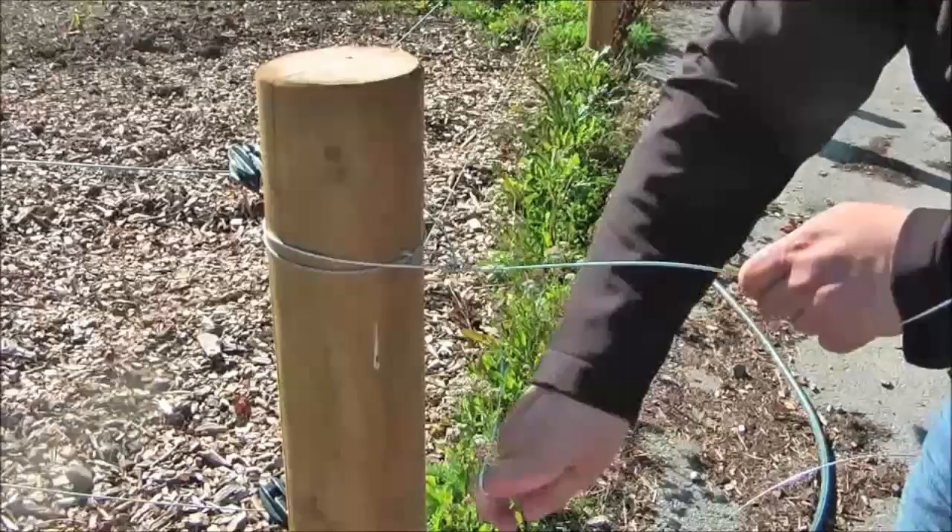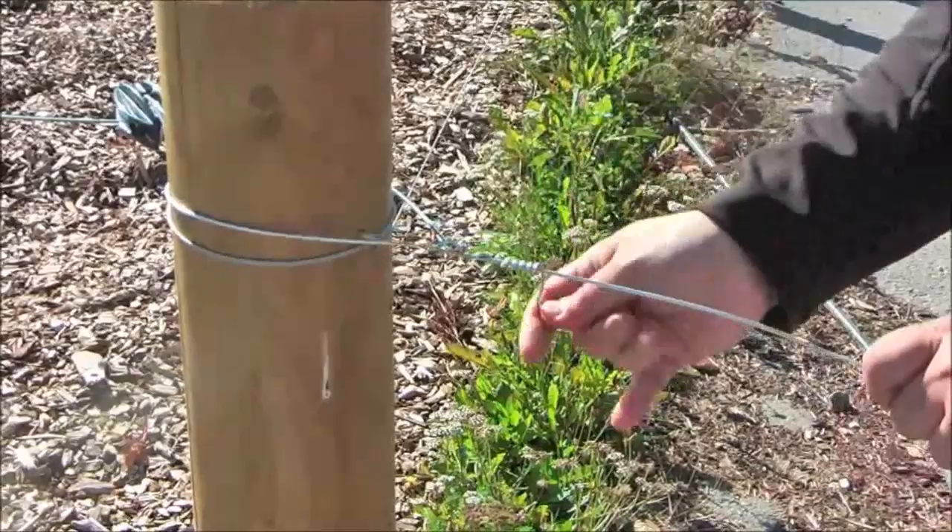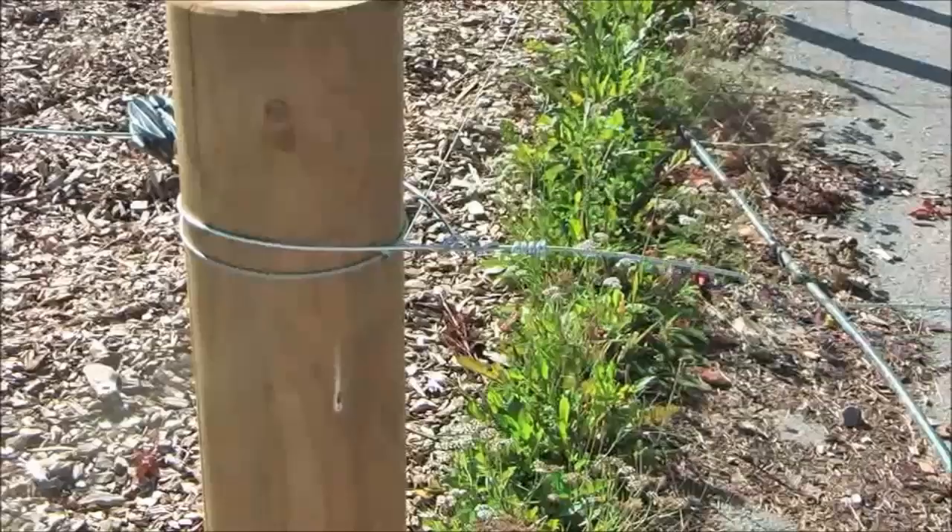break in the wire, bend it under, twist around with a big loop at the beginning and ending of it, four to five twists. Simply break the wire off — see how important it is to have a handle on the wire. That's it: a good and sturdy knot.